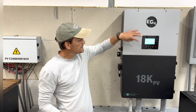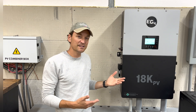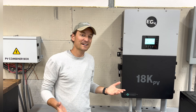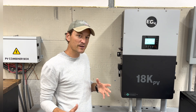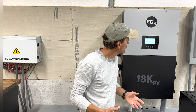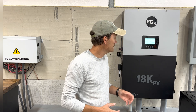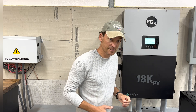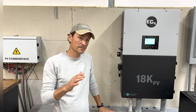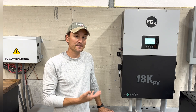It's also extremely quiet. That's why I'm not using my mic now, even though it echoes kind of obnoxiously — I just wanted to let you guys hear that it's kind of like the sound of silence. There's nothing going on with the unit unless you're around 6,000 watts. Right now we are a little over 2,000 watts of PV coming in. It's very overcast today and almost 3,000 watts we're using in the house. It just doesn't do anything sound-wise until you get around 6,000 PV or you are using around 6,000 watts. Otherwise it's like it's asleep.